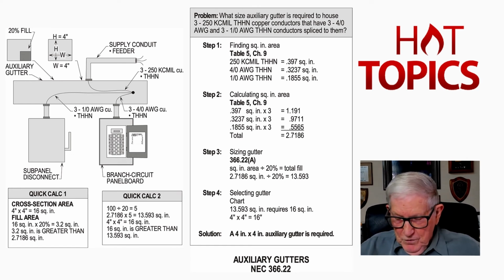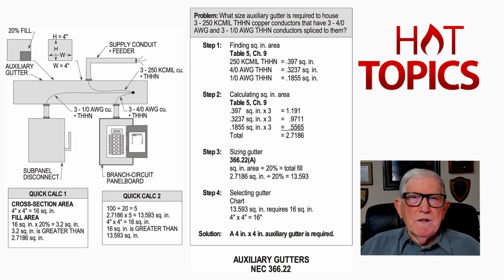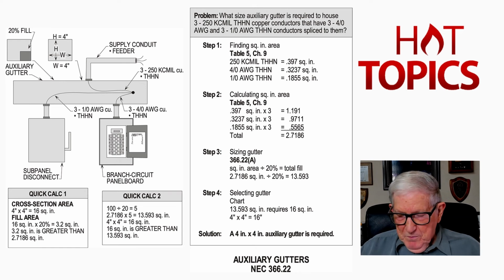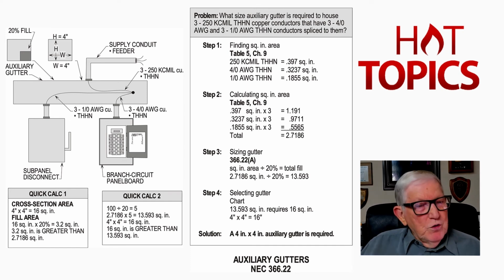And if we wanted to go over now and look at 376, go over to page 229, or kind of mark that down. And on the right-hand side of page 229, down at the bottom, we pick up 376.56, title head, splices, taps, and power distribution blocks. And then notice, to save a little time here, we'll go to page 230 on the left-hand side of the page and drop down to item number 4 under B as in boy, title head, power distribution blocks, and we